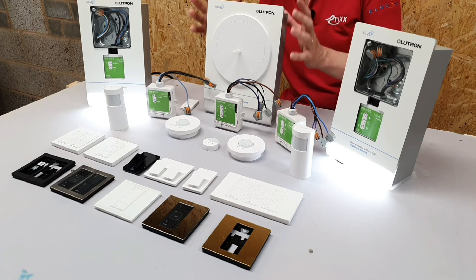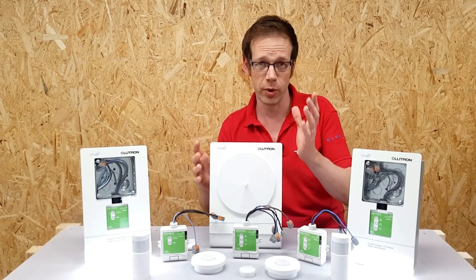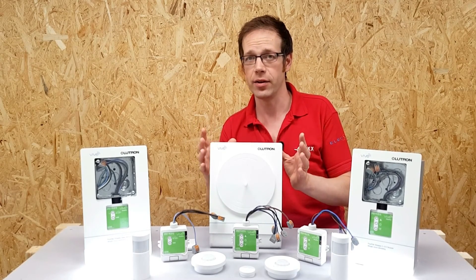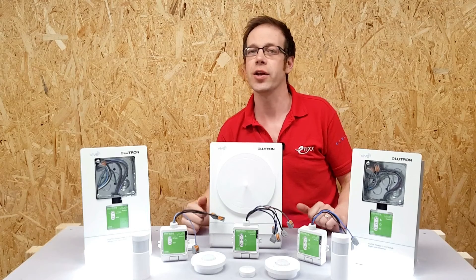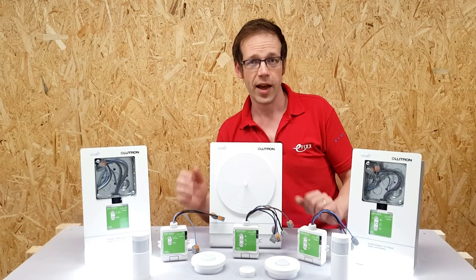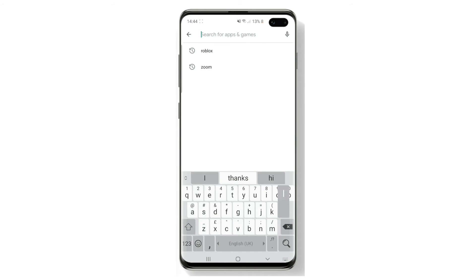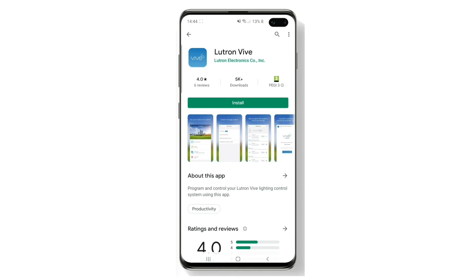The hub further demonstrates the certainty of the Vive system. It has two radios: one generates a Wi-Fi connection at 2.4GHz for access to the app via your mobile device or tablet, and the second operates at 868MHz using Lutron's patented technology, Clear Connect, which guarantees stable connections for the critical control of lighting — something that can't always be said for the crowded and unregulated 2.4GHz band. Lutron also provide the Vive app free of charge with no subscription fee, easily downloadable from the App Store or Play Store, removing one of the final barriers many people have to smart lighting control.